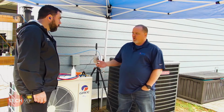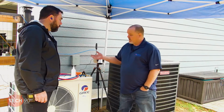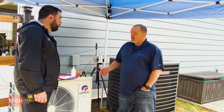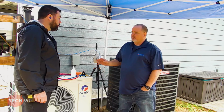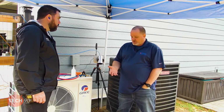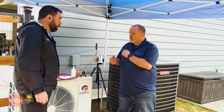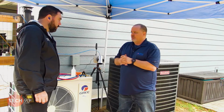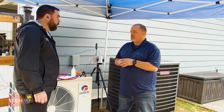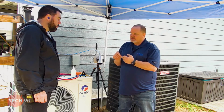But I don't want to put a valve core back in a vacuum. So what I will do is take a gauge hose and gauge and just put enough pressure in there to break the vacuum. It might only be 3 or 4 or 5 pounds of pressure, and it's just going to be vapor, PSI. No liquid. Right. So that way I can put the valve core back in, and it's pressure to pressure instead of me trying to shove a valve core back in with the core removal tool while it's in a vacuum, because I'm afraid that little split second you're going to get a little air in that system.